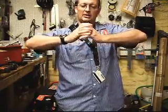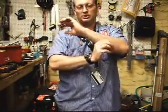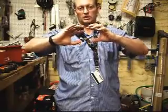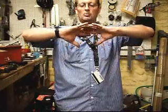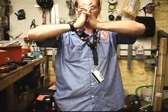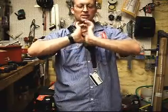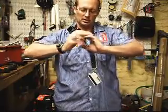As you crank it together, you got to watch, because there's a cold core. Consider the palms of my hand, like this is the round belt, and this is the melted part in here. But then you're going to have a core that is not so warm and not going to fuse together as well. So as you crank this together, you got to watch that you don't crank it so much that the gooey part goes past each other, and then you get to the cold core, and you're pushing the core together. Once that core is pushed together, and if that fuses, it's going to break really easy, because it's a cold weld right there. It didn't really make a good union. So that's what you got to watch out for.